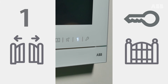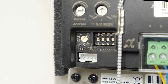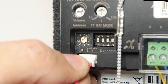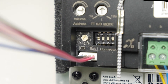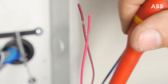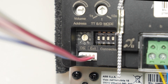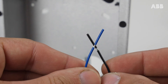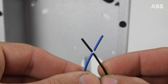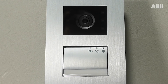you must activate the outdoor station configuration mode to set the timed opening of the motorized gate. Use the small connector included in the kit so that you have access to the four available wires. Set the outdoor station address to zero by turning the jog wheel using a flat screwdriver. Continue by producing a shunt for three seconds on the DS input, corresponding to the black and blue wires in this video.